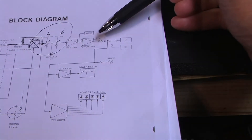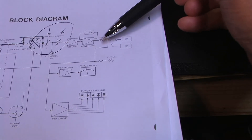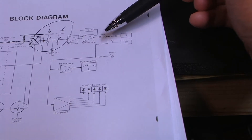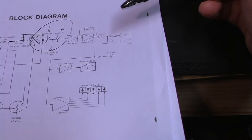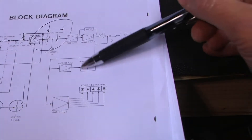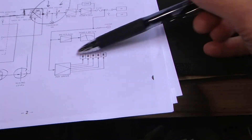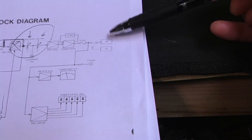Out from the power amplifier is the speaker fuses — not the mains power fuse that's internal, but actually speaker fuses on the back panel of the amp that are accessible to the user if they blow them. Following the fuse is the hookup to the VU meters, as well as the LED peak indicators, and then of course to the speakers themselves.